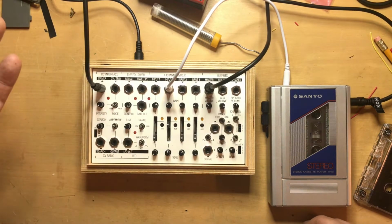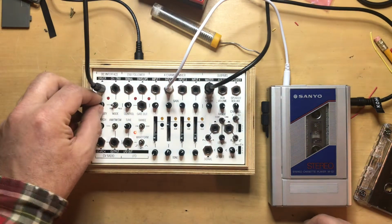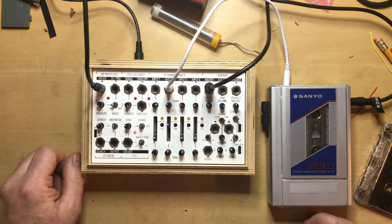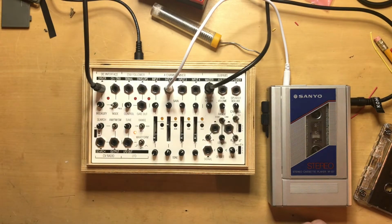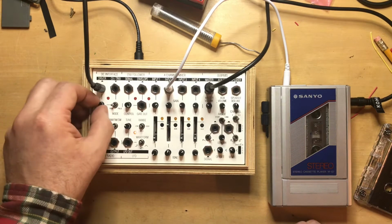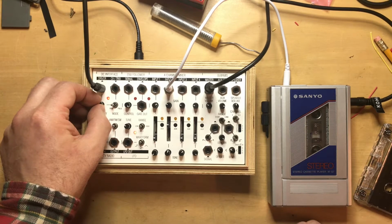The Koma instruction manual says it goes up to 9 volts, and the intensity changes the voltage, that is, and I believe also current that is driving this. So you don't want to start with it all the way up, because then it's going to put 9 volts right onto your tiny little motor and it's going to burn it out. So I'm going to start turning it up and starting to see a little glow. Nothing's driving yet.